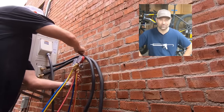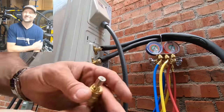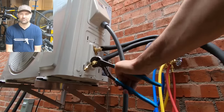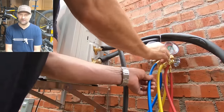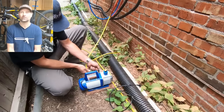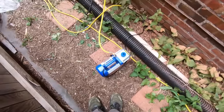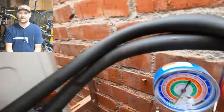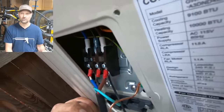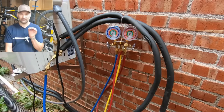At this stage, a lot of guys just let her rip — potato chip. But on the handyman, we go the extra mile. So I'm going to hook a vacuum pump up to the line sets and suck it for about 30 minutes. That fitting you just saw me put on — a lot of mini split kits are now being shipped with that to make it easier to hook up a vacuum pump. Now, there probably will be some professional HVAC technicians in the comments saying you need to charge your lines with nitrogen and see if it holds pressure — not just a vacuum. You can't use a vacuum alone to determine if there are leaks.